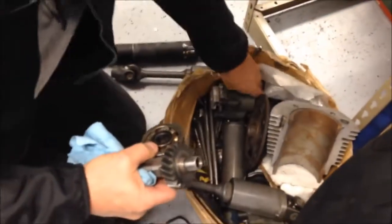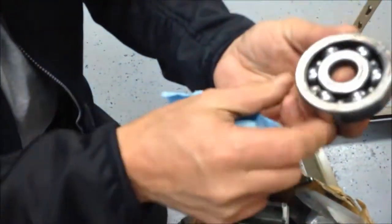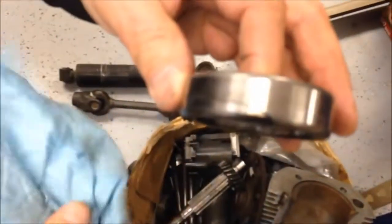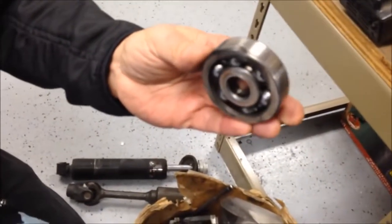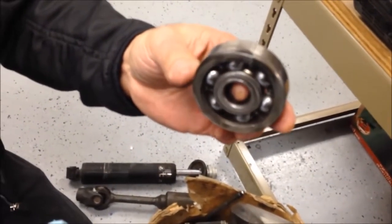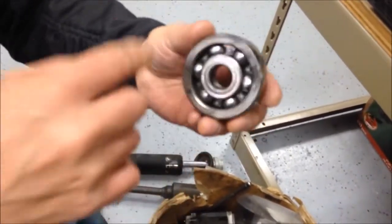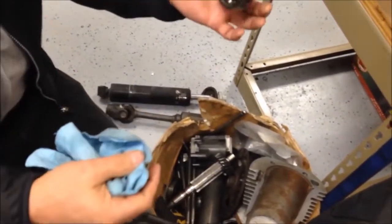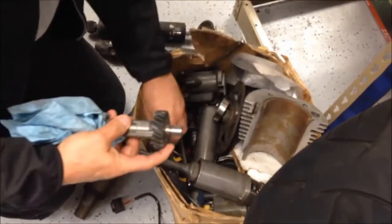I have another one in my little box here — here's another one. I mean, this is how many of these I see. You can see where fifth gear was rubbing up against the bearing and how it cracked it right here. You see that crack? So, that was — if you ignore the missing circlip, this is the gamble that you're running. You're basically going to damage your bearing and lock up your rear wheel. It's costing you more money by not getting it fixed early, because this is what's in your future. The landscape is littered with it, unfortunately.